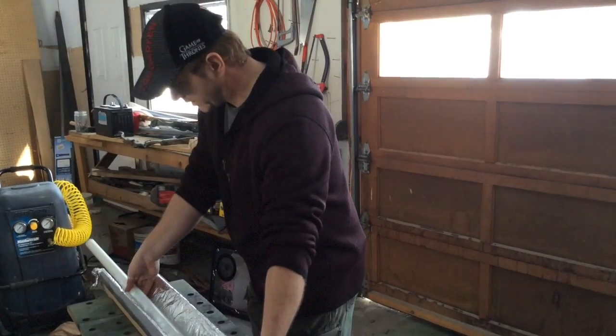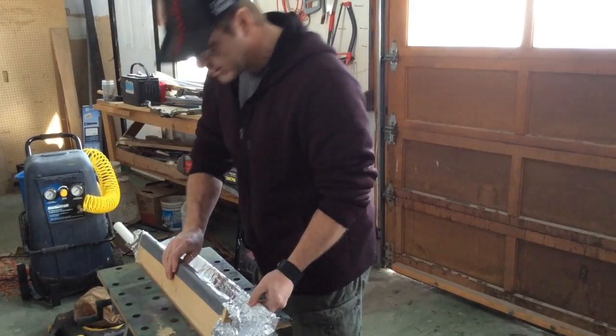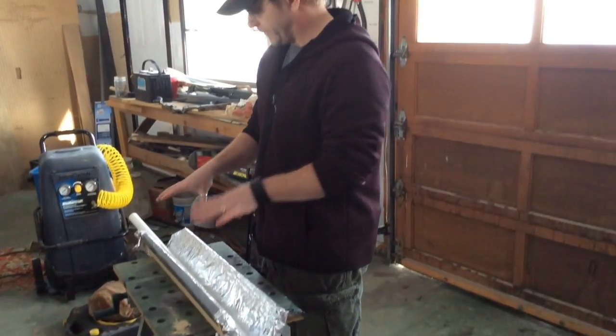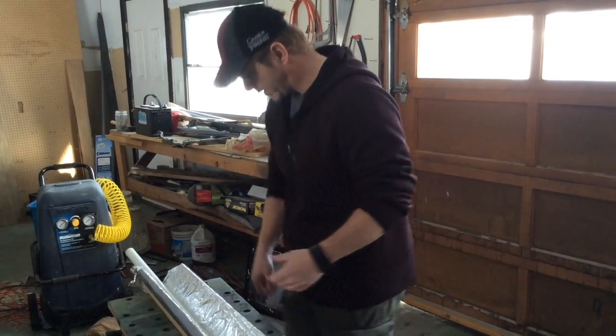The process here — if you want to build yourself a nice little trough like this, a couple of 1x6s and some tinfoil. What that does is get your heat — when you're using your heat gun, it traps a lot of that heat in there so it cuts your heat-up time in half.